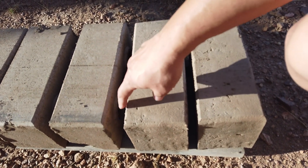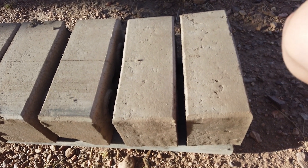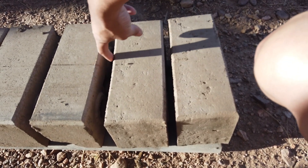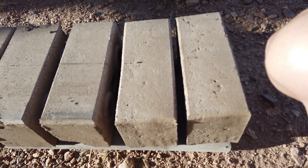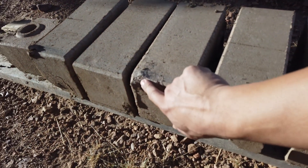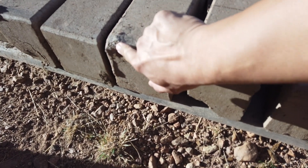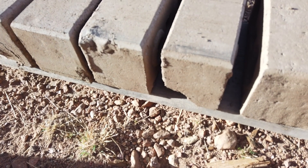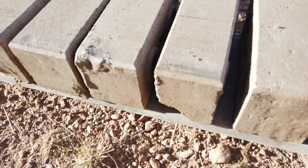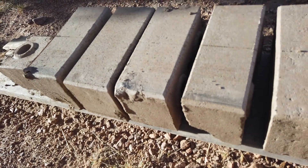You can see this brick is actually curved right here. The reason for that is when we took it off the machine and set it down, we set it on a surface that wasn't perfectly flat. So as it cured, it cured with a little bit of a curve to it — that's one of the things we've got to work out. These are handprints from when I picked up the brick while it was soft. You can see it's hard as a rock now, but when you first pick it up it's super soft, so I didn't have the delicate touch yet to keep it from caving in.